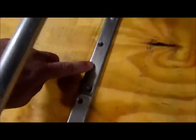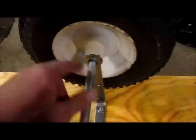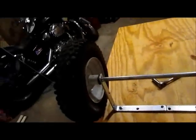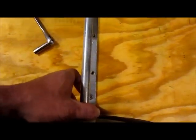And the leg, the axle support I'm using, you can see the shelf bracket. I'll make the hole a little bit bigger, from a half inch, in order to put the 5/8 axle through this. Maybe a little offset. We'll put a brace from here down to here and pull this slightly forward to make this straighten up. And right here's the brace I'm going to use.